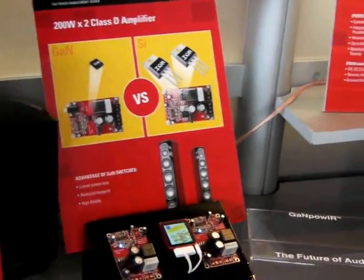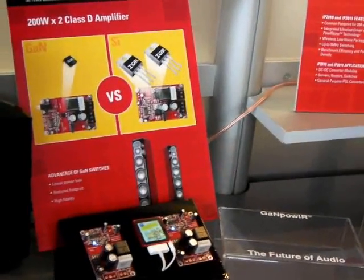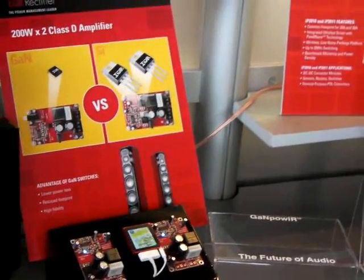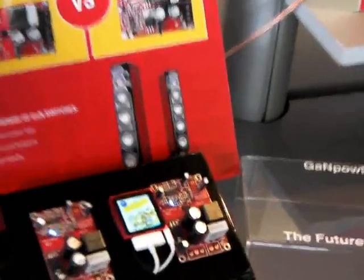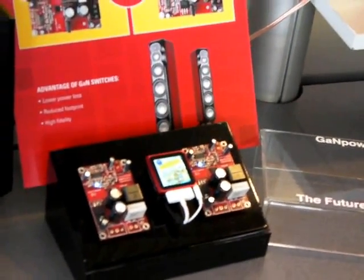which is really an incredible small example of how GaN can actually deliver an incredible shrinking of the semiconductors that we use today. The original design was based on a trench FET on a TO220 design, which you can see on the right-hand side. And we took that design and tried to implement a dramatic shrink in dimension.